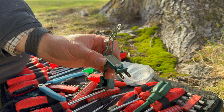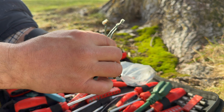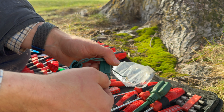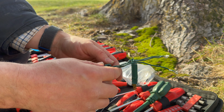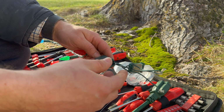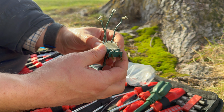Okay, well, next troubleshooting step here, I've removed the wires from this plug end, so there's no wires connected. I've got new fuses in it here. We're going to plug this back in, see what happens. If the fuses don't pop, everyone, that leads me to believe the problem is still in the strand somewhere. I just don't know where. So we're going to try this, Evan, and be careful about it. We don't want to touch anything here.